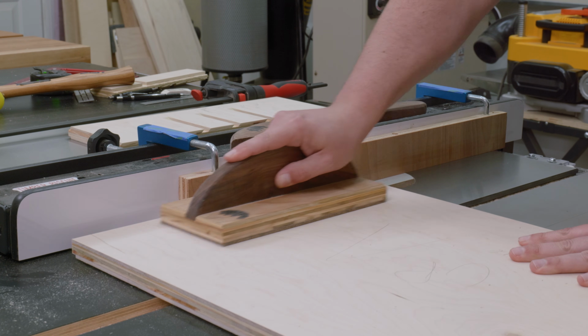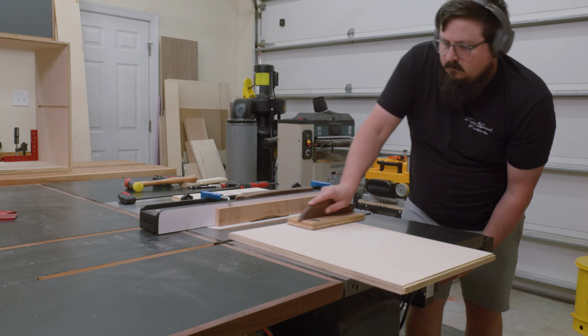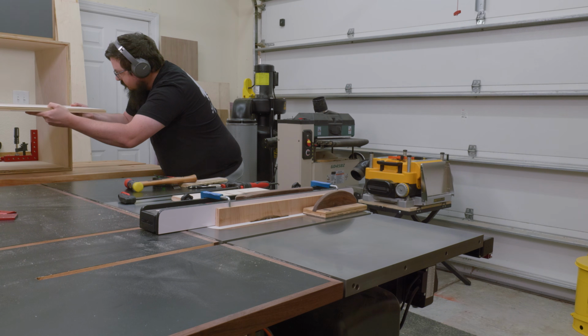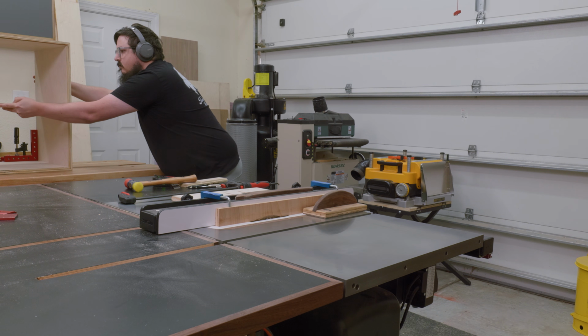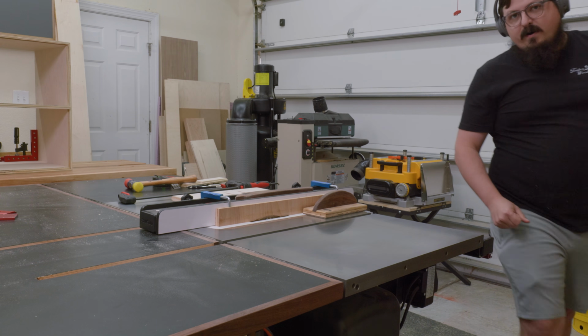So while on some pieces I do love using shelf pins, I think in this instance, fixed shelves just made sense. So what I did here was follow the same steps I did for the vertical partitions, where I assembled everything in the carcass, and then took my measurements before cutting everything down and cutting the tenons on the shelves. And with a little patience and good luck, the shelves fit perfectly the first time. Then I could say something like, I think that looks alright.